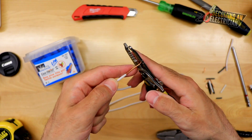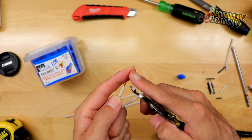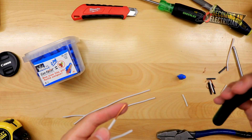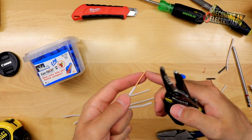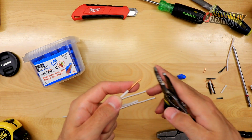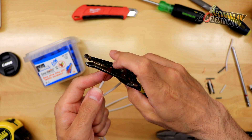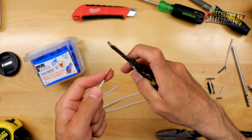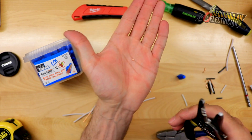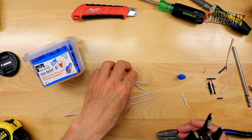Same when you cut the copper — copper is a metal, and if a little piece of copper goes on the countertop, someone might put their tools or something on the counter, and if it rubs on the copper it's going to scratch the countertop and they're going to look at you as the electrician. So when you cut, same thing — it's sticking out just a little bit. Put your finger here and cut — you catch it and make sure to throw that out. It's all about knowing these little tricks.